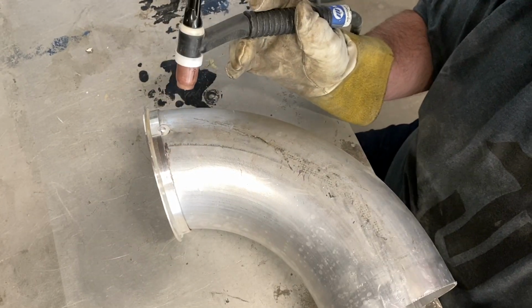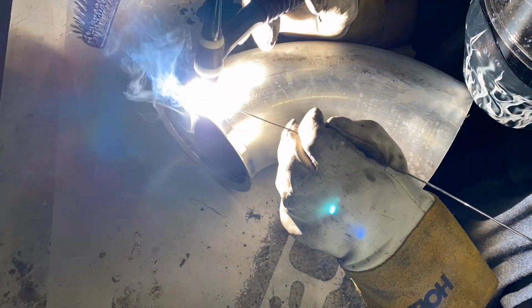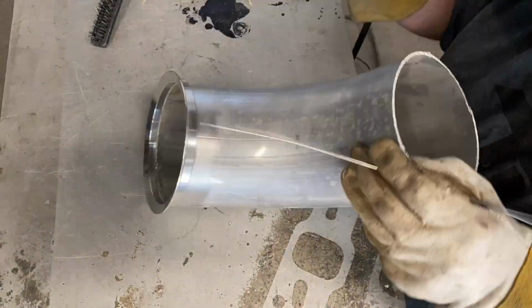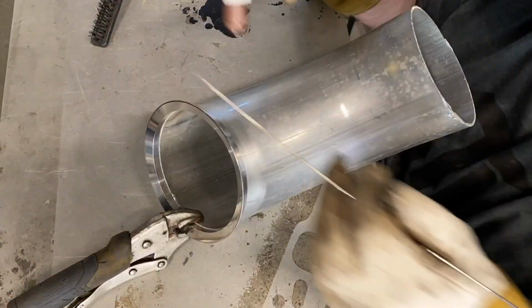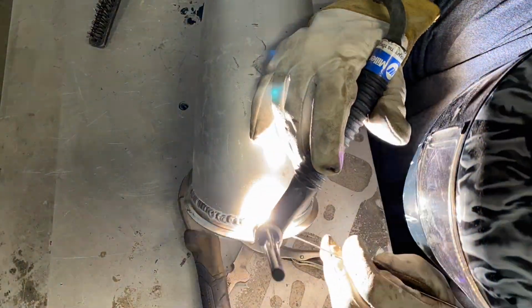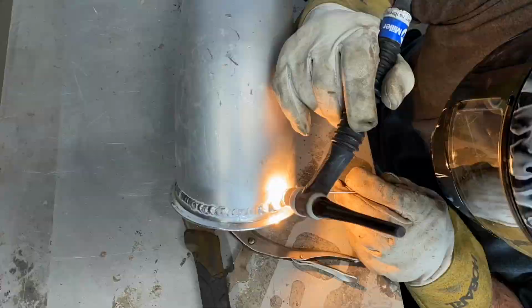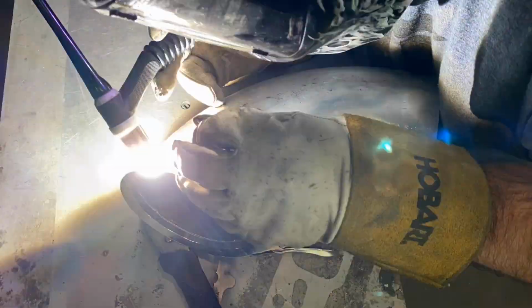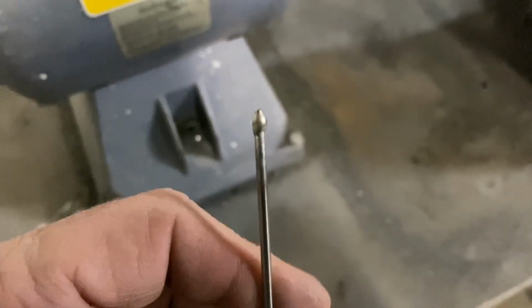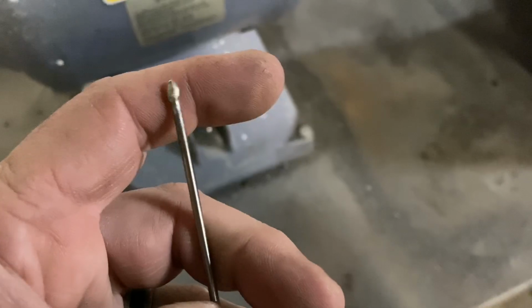The weld doesn't exactly turn out beautiful for me, but it works. If your amperage is too high or you stay in one spot too long, you will blow a hole in the base metal, and then you have a hole you have to fill. So you have to move fairly fast. But the good thing is you have the control of the power in your foot on the pedal. Ease off.